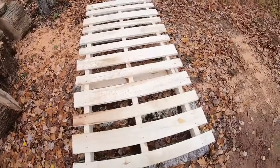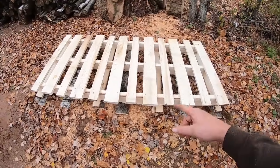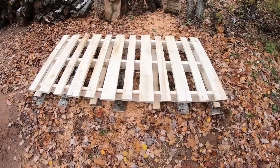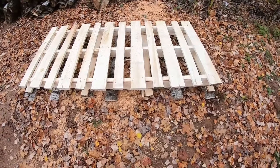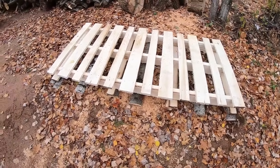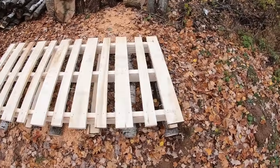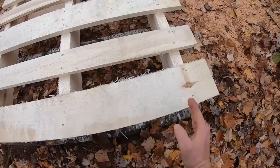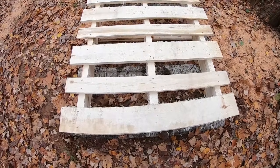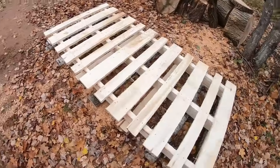And we just throw them on pallets. So here's one. We just knocked this together from some of the practice lumber that Senior has been making, tuning in his new band mill. This is just some popple. And yeah, 4 foot wide pallets. I think these are 8 feet long. We made a series of these, and having 16 inch long chunks of firewood means that you can get 1, 2, 3 chunks stacked across a 4 foot wide pallet, and it fills it up perfectly. So that's pretty much all you need to know about the setup.